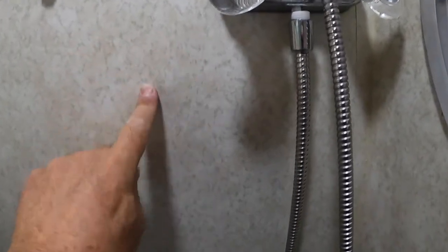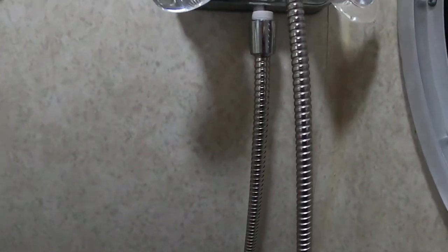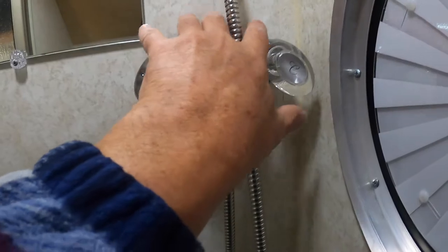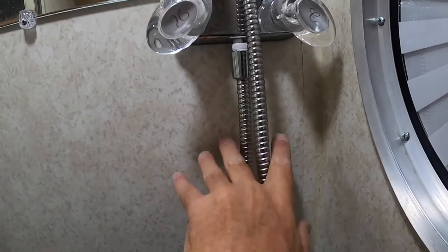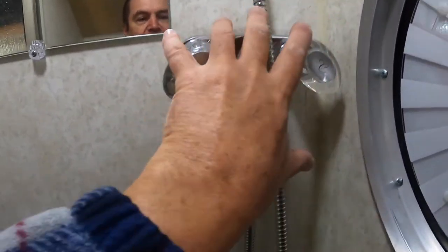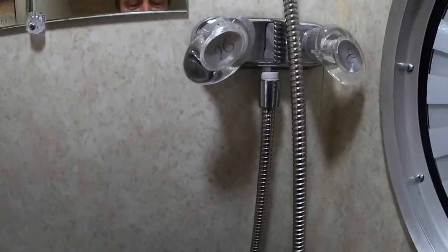When you sit in here, I've been thinking about putting it over here on the left but it's kind of crowded. I have two choices — this wall which is hollow and this wall which is hollow. I've got a stud right here and a stud right here, and this area is hollow. On the other side of this wall there's an inspection panel so you can get to the two lines that run down here. What I'm going to do is move these shower faucets down by about six inches to a foot, and put the toilet paper holder right where this is. Let's go outside around the other side of the wall. This is going to be a really nice, easy install — it'll be out of the way, really nice.